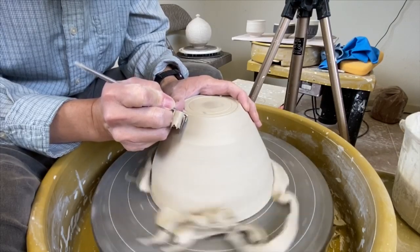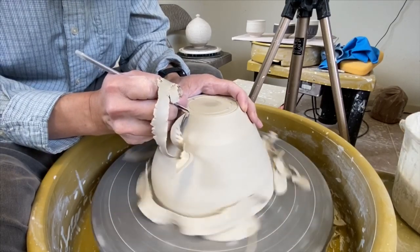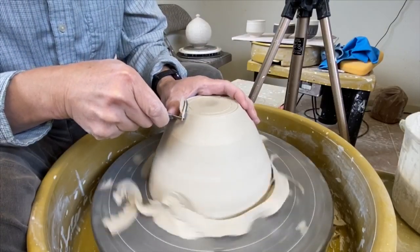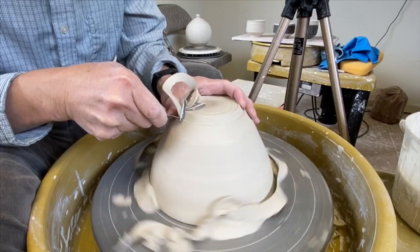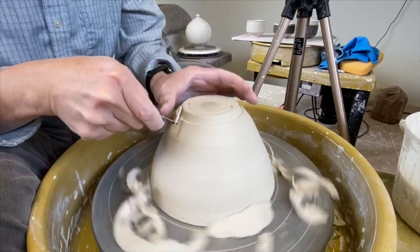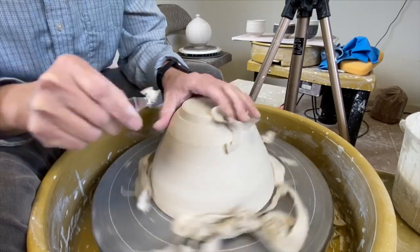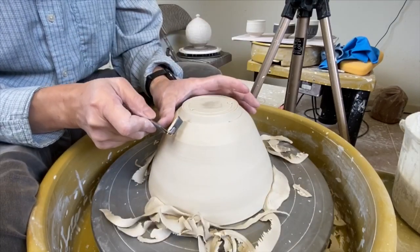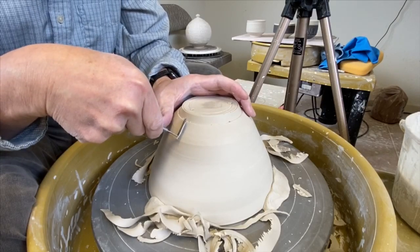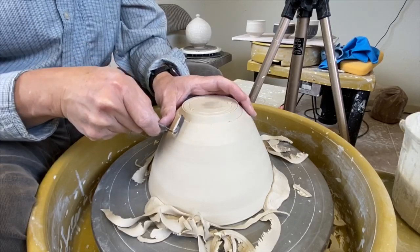To avoid the vibration, you want to make sure that you hold the tool closer to the corner. Okay. If you feel there's a vibration, just change the direction, or the way you hold the tool. Sometimes you hold the tool more like this, it's kind of scraping. If you hold more at an angle, this is cutting. So the angle also plays a very important role when you are using my tool.